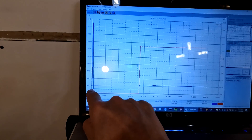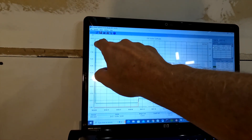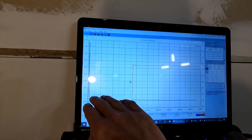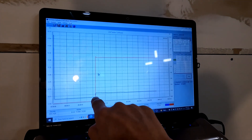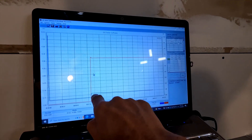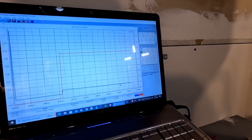This battery completely fooled me. I just started the discharge test and when it started, the voltage shot all the way up to almost 18 volts and then shot right back down. The battery was already full — it knew it was full so it shot up really quick and then stopped. Then when I started the discharge test, the voltage went from 12.9 up to about 13.3. I think this is a feature where the BMS holds at a lower resting voltage, but I find that pretty interesting.